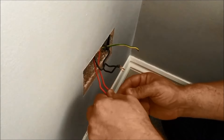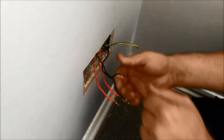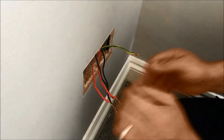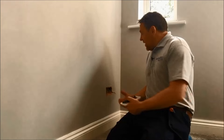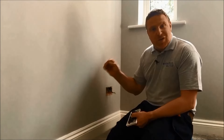Now we've got our wires. I'm going to straighten them back out again because I like to be neat and make sure they go in nicely. I'm going to straighten this back out and make sure we've got enough earth there. A little tip: when you get the brand new socket, in the back will be some small screws, usually about an inch and a quarter long. Sometimes the original electrician put the box a little too far in and had to use a longer screw. So keep the screws from the original socket — we'll probably reuse them if the new ones aren't long enough.